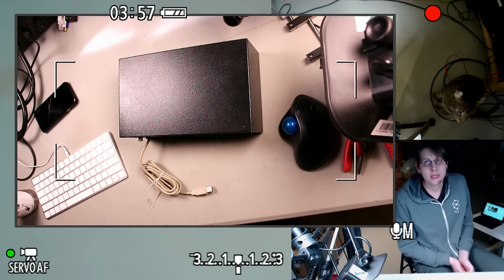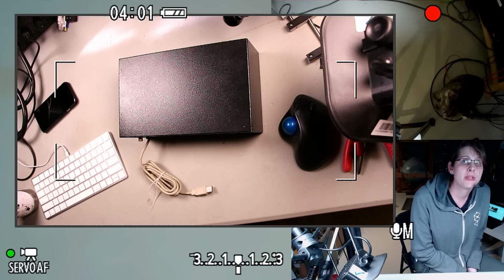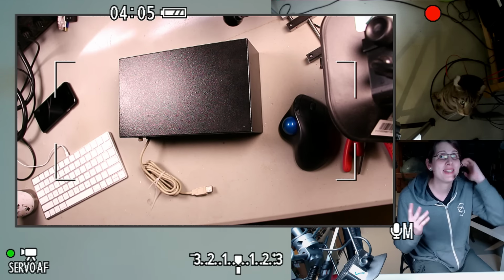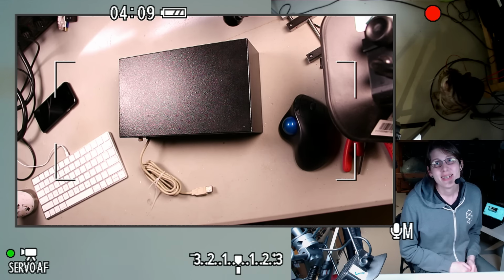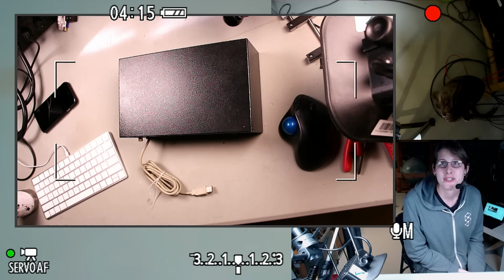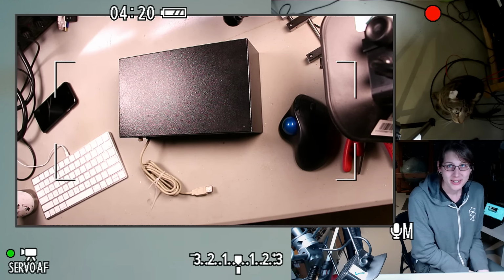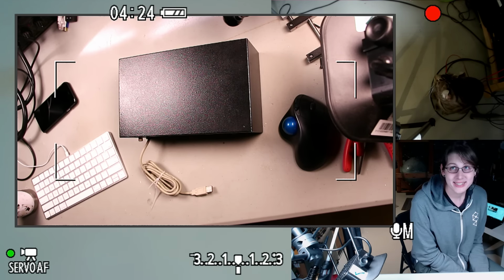And so the 480 megabit is also the fastest you'll see on the original twisted pairs, because USB 3 added totally new sets of wiring for the high speed, or super speed, because of course they needed a new name. So high speed is 480, super speed is 5 gigabits, and I haven't even read the 10 gigabit spec, so somebody will probably have to mention in the comments what they named that, because I haven't gotten around to catching up with USB. What was that, 3.2? Yeah, USB-C is leaving me in the dust.